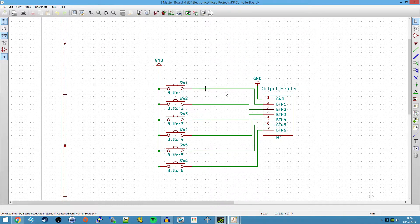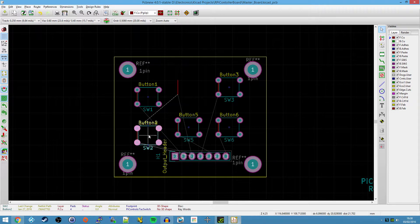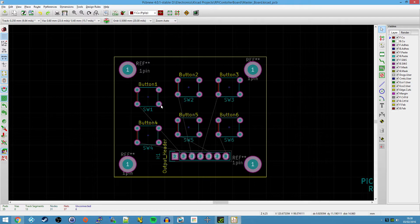What we can see here is, for example, button one is connected to pin two, button two connected to pin three, button three connected to pin four, and so on. But when you translate that into a physical design, you can see some of the problems. These white lines coming down here show where the connections are actually supposed to be made. I don't particularly want to mess around with this layout because I've got it set out exactly how I want it. The reason I laid this out like this is because that's physically how I want the buttons - going left to right, top to bottom: one, two, three, four, five, six. But as we can see, the connections are all over the place, so drawing traces is going to be an absolute nightmare.